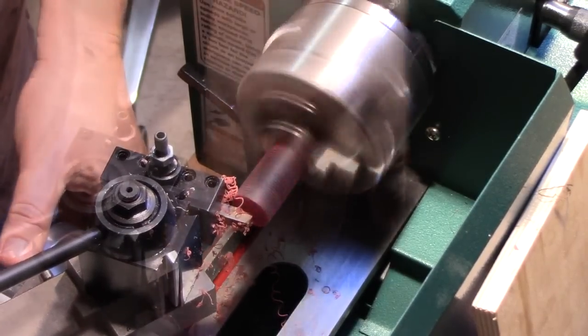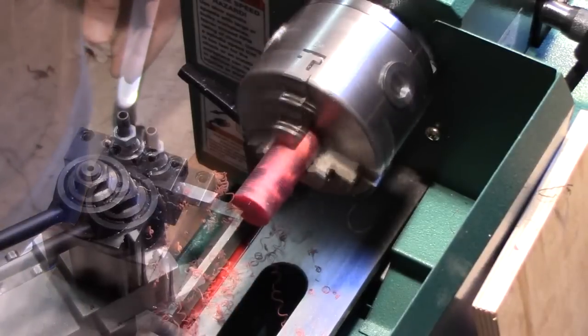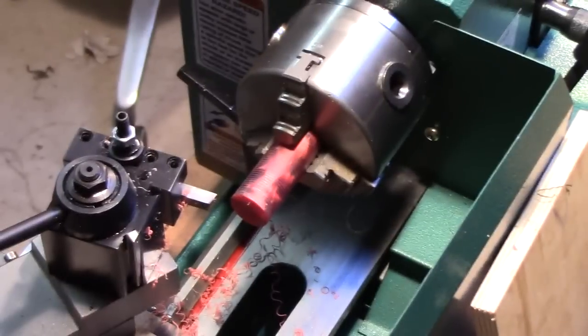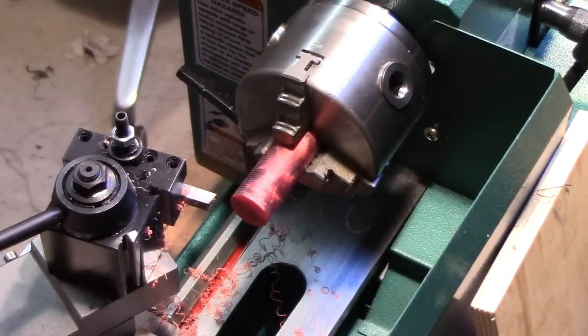Next step is going to be drilling. And we have to drill in steps because the final diameter of the air hole at this end, which is going to be the tenon end, is quite large, and we don't want to drill that large all the way through. Plus, we need to make pilot holes and so on.